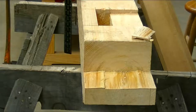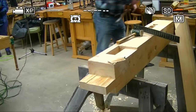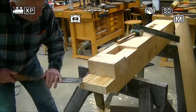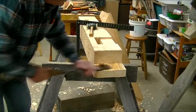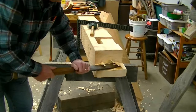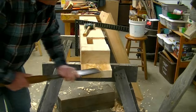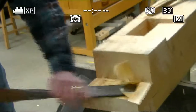I'm going to get a slightly different chisel. This is referred to as a slick. And as big as it is, we never strike this with a hammer — this is a hand tool. I'm going to use this to get the high spots off. Ultimately, you can see my line down here — that's where I want to end up. But this allows me to do that very quickly.